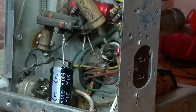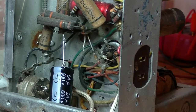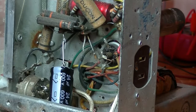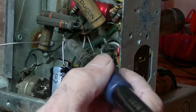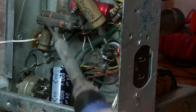And that will hold. And as one of the shows I watch religiously is on electronics, is D-Lab, hosted by Terry Dayton. And this is where I got this particular technique from. And he's right, it creates a mechanical join. And the solder, which isn't very hard at all, it's quite soft, just is the glue that holds it all together. And I'll just solder it up. And that's running, that's good.